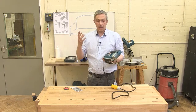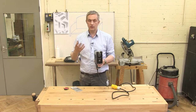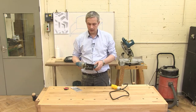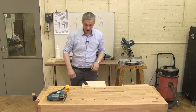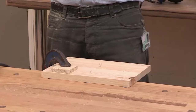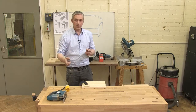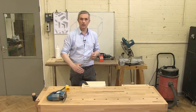It's a very safe tool. Eye protection is needed as it kicks up quite a lot of dust, and ear defenders because it is quite noisy. If cutting MDF or hardwoods you'd definitely want a dust mask or local exhaust ventilation — plug it into your hoover. For this softwood shortcut we're okay with just ear defenders and eye protection. I've marked up a curve for the back of our bookcase. Note that I'm cutting quite a little bit away from the line — unlike mortise and tenon joints where you cut right on the line, with a jigsaw you cut maybe a couple of millimetres away and then finish the curve with something else.